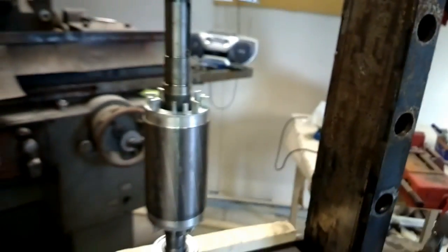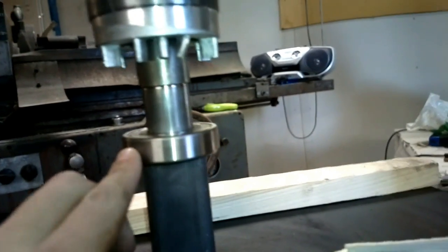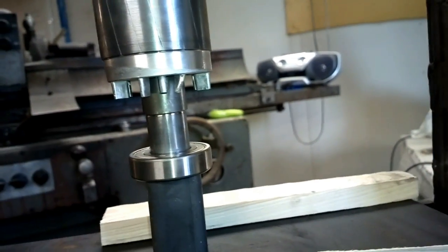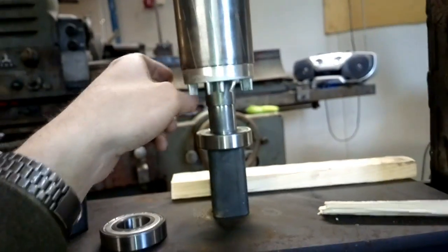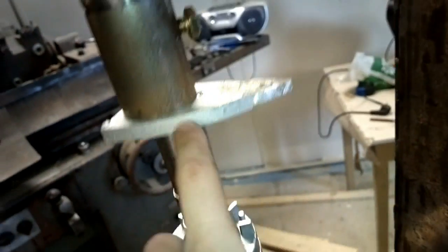This is a pretty long piece to be set on a press, but I could do the setup pretty easily anyway. So I have this square tube under here, and the bearing is now just a little bit started — I pressed it in just a little bit. And it should go all the way to here. With my cylinder I am pressing the whole axle through this bearing. Right here I have enough room for the shaft to go down, and I also have a hole in my table. Never press on the shaft itself — I have a piece of soft aluminum in between.